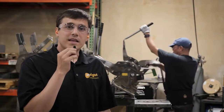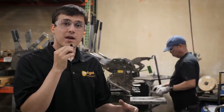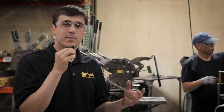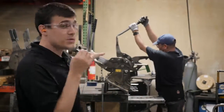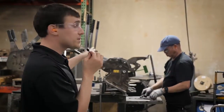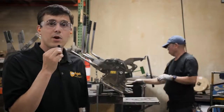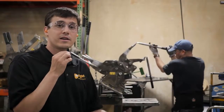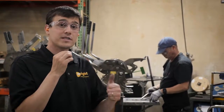One thing that's important to us as a lean manufacturer is that we don't always have a really big, high production machine to make a part, because oftentimes those kinds of machines require really big changeover times. In order for us to be able to flexibly build whatever mower is next in the schedule, we often downsize our equipment. So here's an example of that. These presses here, rather than setting up one bending machine for 5 different parts, changing between those setups, we have a bender already configured for each of those different parts. So we put the part in, we bend it, and we go make a mower. We don't have to do a big setup and then run a ton of parts that all sit in inventory and slow everything down and contribute to bad quality. You'll see this through our process, that oftentimes we downsize the machine to increase the flexibility.